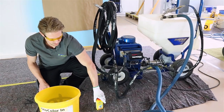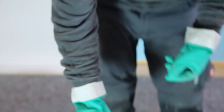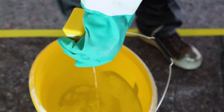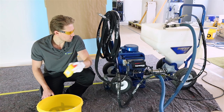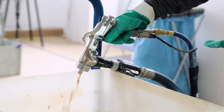To do so we'll be using a highly concentrated caustic soda. With this particular one we mix it with between three to five liters of water, and we'll pop it into the hopper and then turn the sprayer on and just get it working within the machine — and that should get out any leftover bitumen.